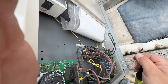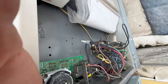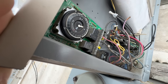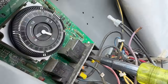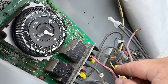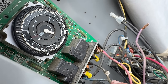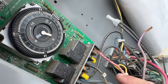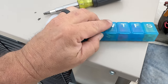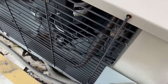For god's sakes — that's why it should have a crimp on it, not this rinky-dink jackery crap they've got going on. That poor connection is probably not giving a very good connection to the heaters, since it feeds from there to the heaters. The heater wire is number four. Either way, we're going to clean that up. It just ain't that hard to do stuff right — it really irritates me.